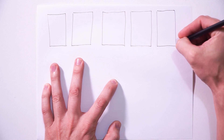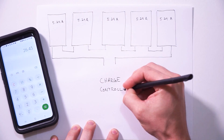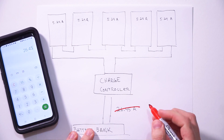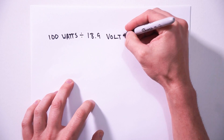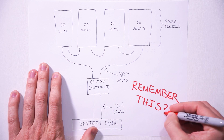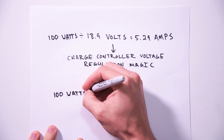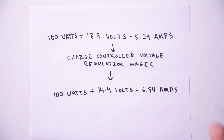We need our panel specs once again. You may notice the max operating current of the solar panel is 5.29 amps, and you figure you'll just multiply that by 5 to get the total amps the solar panel array can produce. But don't do that — it's not that simple. That 5.29 amps is the result of 100 watts being pushed by 18.9 volts. We're not charging our batteries at 18.9 volts. We need the charge controller to regulate the solar panel voltage down to a voltage more conducive to charging the batteries — so let's say something around the 14.4 volt range. This means if those 100 watts are being pushed at 14.4 volts, the batteries are actually going to charge at 6.94 amps per panel. That's 100 watts divided by 14.4 volts giving us 6.94 amps. So the amount of amps we have to work with is directly related to the amount of volts we have to push with.